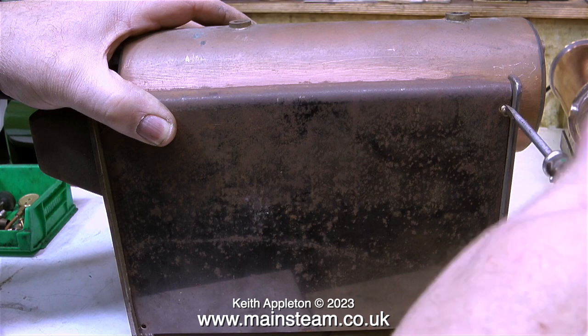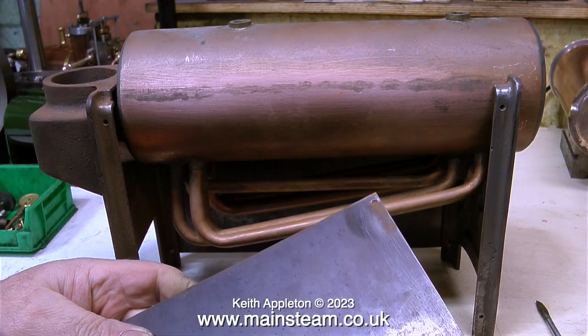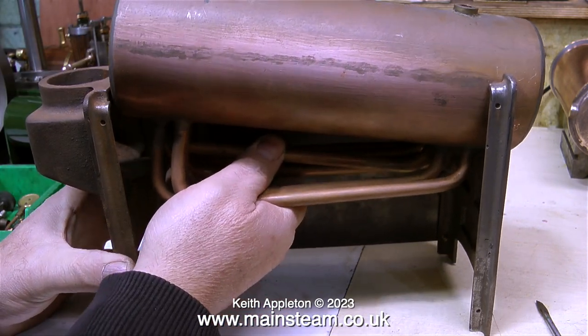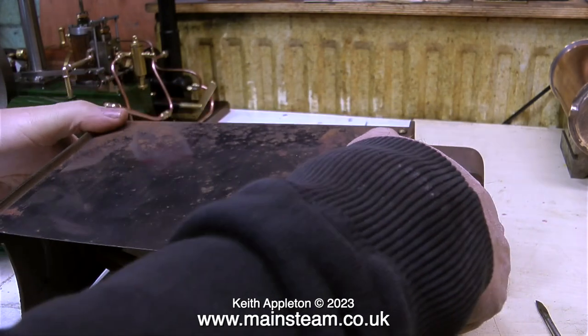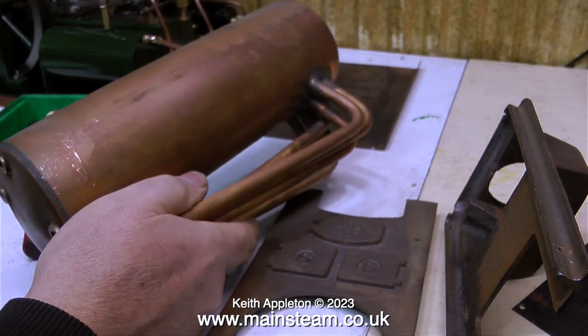At this stage I have to issue a major health and safety warning — this is a sensible one. These boilers were manufactured in a different age, before we knew how dangerous asbestos could be. So behind each of these side plates was a sheet of asbestos board. When I first received the 504 boiler I opened the box outside and removed the asbestos board, disposing of it by the approved method. I also cleaned off every trace of asbestos found on the castings or the side plates, so back in the workshop all boiler components are 100% safe to handle.